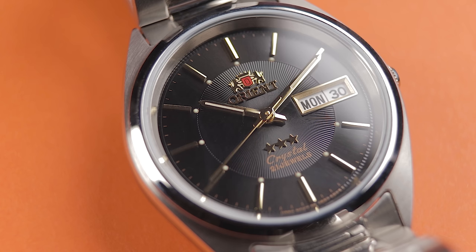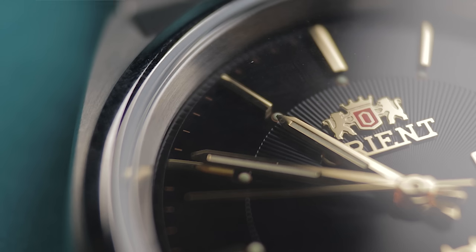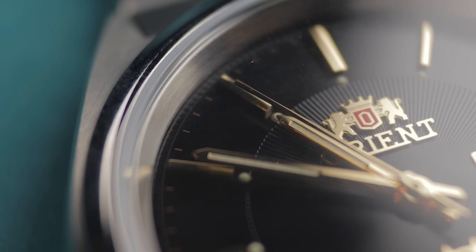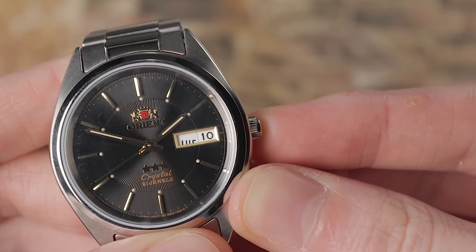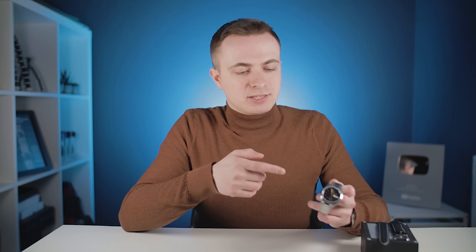You'll notice the second hand beating along rapidly, as we are even getting a mechanical movement in this budget watch. Inside is an in-house 21-jewel Orient automatic movement, which I believe is the calibre F4902. This movement isn't much of a looker, which is why there's no exhibition case back, though it is known to be a very reliable workhorse that should last well over time. This one runs just over 10 seconds per day fast, which is completely fine. Just having an automatic movement and a smooth sweeping second hand make this watch feel more expensive than the retail price would suggest. This movement also gives the watch both day and date functionality, adjustable by rotating the crown clockwise for the day and anti-clockwise for the date. Most fashion watches around this price almost exclusively contain quartz movements, whereas with this I think you get something a bit nicer.